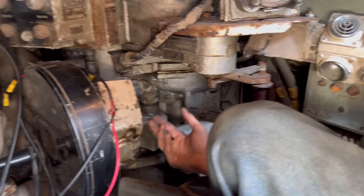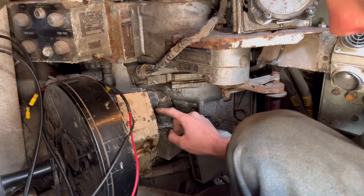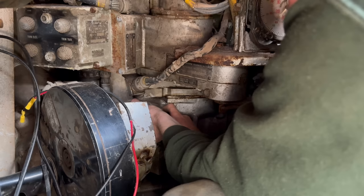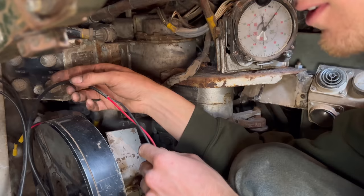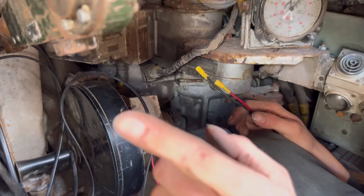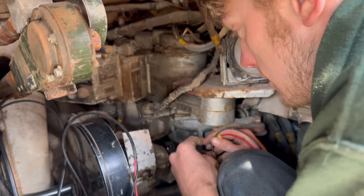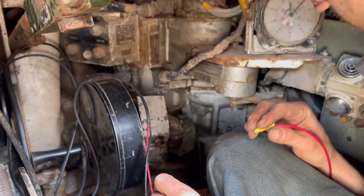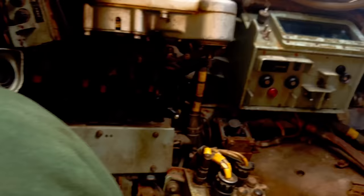This is the motor when it's in the slot. Apparently the traverse and elevation motors are the same. I'm assuming this is the traverse one which does the left and right spin. I'm going to take off this cable that doesn't seem to be doing anything. These are the two prongs I was lining up. Just in case it is the wrong motor, don't have your head there because the gun could smack the turret and crush your skull, and don't have your kneecaps under there. It does look like it's stuck, which would be why it's blowing the breaker.